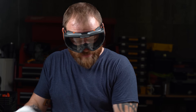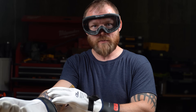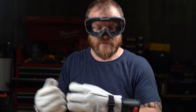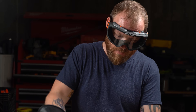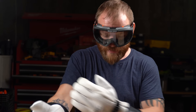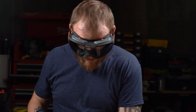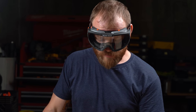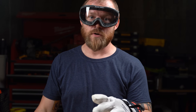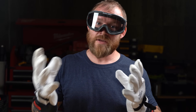Using electrolyte water simulates more of the inside of our bodily fluid, so we'll have less resistance and more current flowing. If we look at raw muscle tissue — which this chicken is — it simulates more of what our skin is. The surface of this is wet, so it's still not a perfect comparison, but it's the closest we can get. The amount of time that you are exposed to electrical current running through your body, the more damage you're going to have both inside the tissue and at the surface. If it's just a very quick contact, you'll still have current going through you, but the damage won't be as bad.